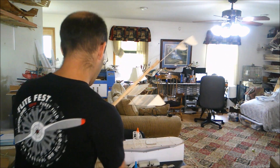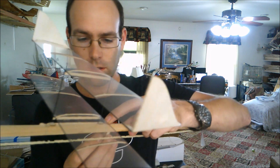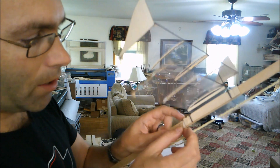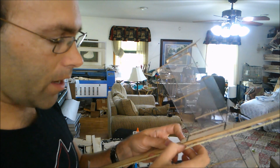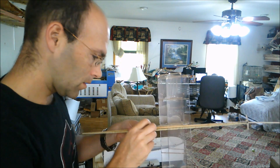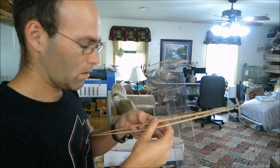No happiness at all. So what I'm going to do is, since I want to skew my wing effectively like this to hold that wing up, I'm going to slide this wing over from the front. What I'm doing is sliding a shim right here at the front. I don't think that's going to be enough — I'm going to put a second one in. So I've got two of those in there.